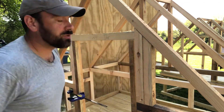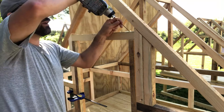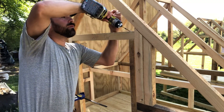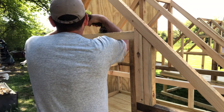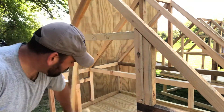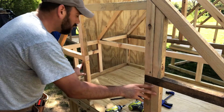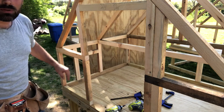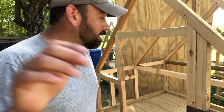I'm going to go with the longer three and a half inch screws because they have some distance to go at that 45-degree angle. And there's our finished doorway. It's made of different chunks but this is a nice smooth surface that's pretty straight, pretty plumb because we used that structure. Now we're going to move on to adding the sheeting to this - that's a fun part.